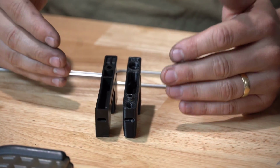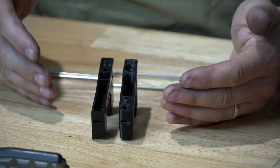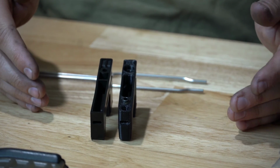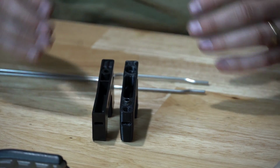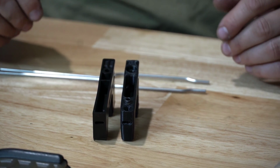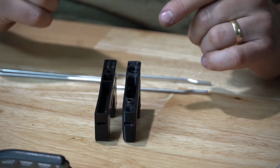One on the right is plastic, on the left is also PLA plastic. We will be making these out of aluminum or a high density polymer of better durability than 3D printed PLA. Right now they are just a mechanical proof. You can use them for shooting range use. Would not recommend heavy use or betting your life on this trigger to function for thousands and thousands of rounds. We'll still cover replacement if you break it, but just want to say that because this is a very functional prototype, not a full production model yet.